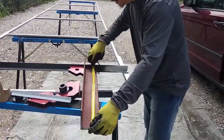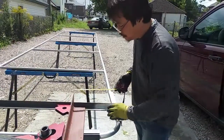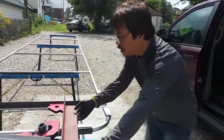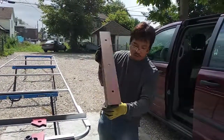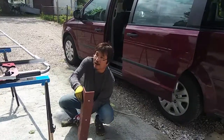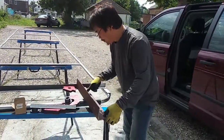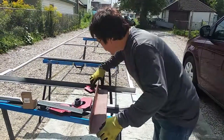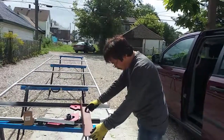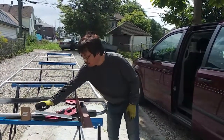Right now we have 18 inches on the arm. We know from here to the ground is 8 inches, so we have 11 inches plus 8 inches equals 19 inches. From the center point we have 18 inches — meaning when it turns all the way up, we still have 1 more inch from the ground, so this won't touch the ground. You can actually open it even more than 90 degrees. The measurement from here to here is 11 inches, so that's where I marked it. We install this one exactly where it is marked — 11 inches from here, 19 inches from the center point to the ground, and 18 inches from the center point to the end.